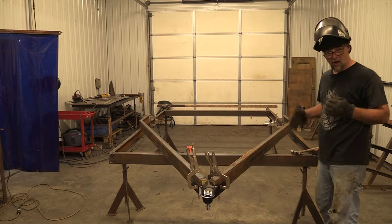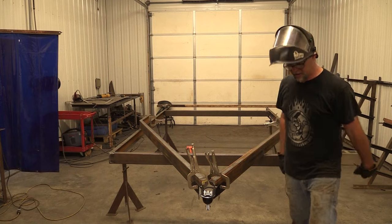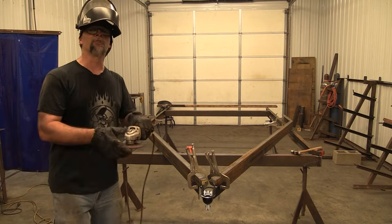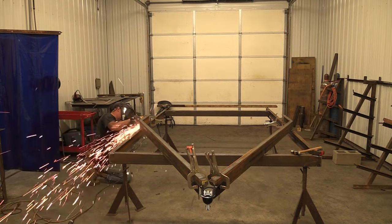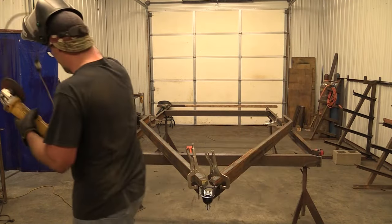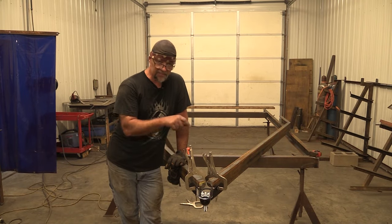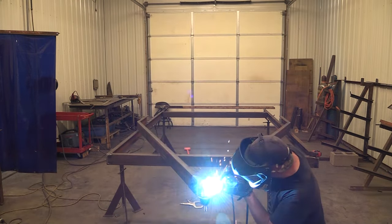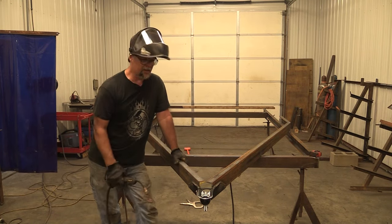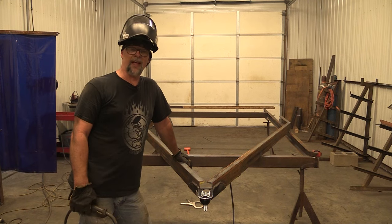Now I'm going to take a hard disk on a grinder and bevel out where the two joints come together where that seam is, then weld in there. This is what I mean by a hard disk - it's a quarter inch thick, meant to be used on the edge, but it's not a slicer disk. So I just made a bevel at two spots about six inches in from each end. Now I'm going to weld those in. Now I'm going to go ahead and weld the bottom side of this tongue and get this coupler welded to the main beam. So we've got our coupler welded on, we've got our tongue mounted to the trailer, got all that other stuff done. Next step - in the next video we're going to hang axles, so stay tuned.